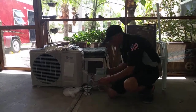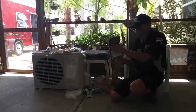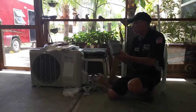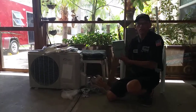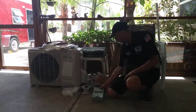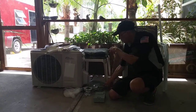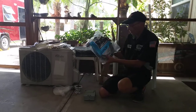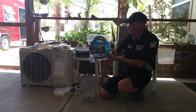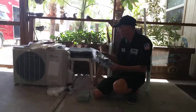One of the things I bought was an AC disconnect — it's a 30-amp basic. All it does is you pull it out and it disconnects the power. That would be code if you install this in your house; it's a good way to go so if you have to work on it, you pull it out — done. I also bought what you call liquid tight conduit, which you can run the wires through to go from the disconnect box to the AC unit.